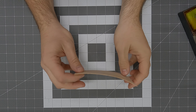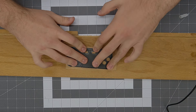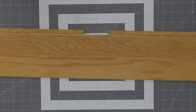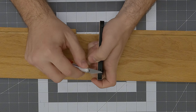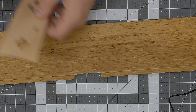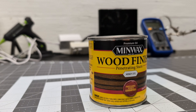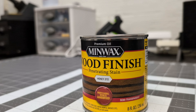To achieve the wooden look I was going for, I went with some wood veneer that I picked up from my local Menards. I super glued a piece to each of the controller parts and very carefully cut it out using an exacto knife. After cutting out all of the buttons, I could finally stain the veneer using a honey stain, which I also picked up at Menards.